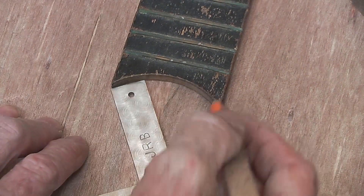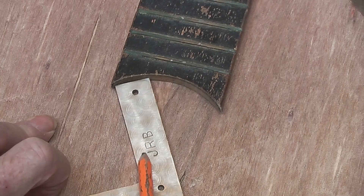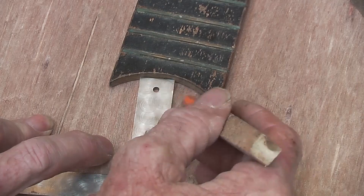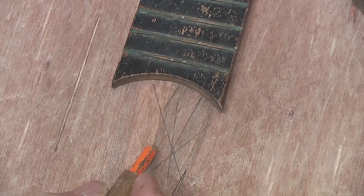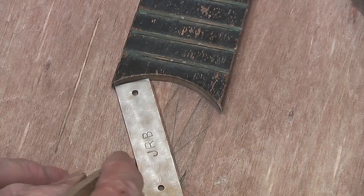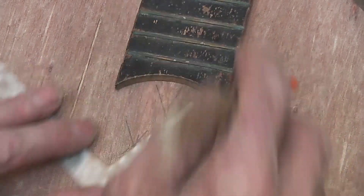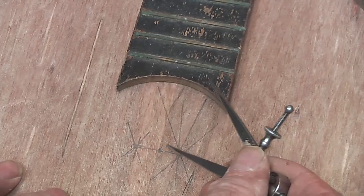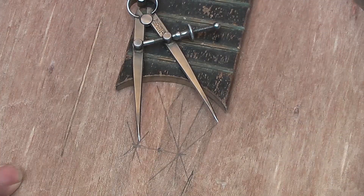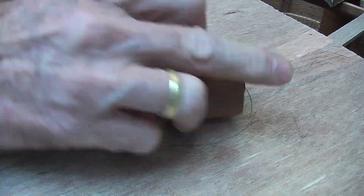I will need to find the center of the sound hole to clamp it down properly. I get a bar like that, and on the circle make a series of lines, which will find an offset point here, but you can see it is not centered. So we go on the other side of the ruler to get the other offset. We are going to get two equal lines, and then halfway between that - down my center line - that will be the center of my circle, and that will mean I can get my circle correct. Now I will cut the hole a little smaller than I need to, so I can ream it out later, but I do need the hole to be able to clamp.